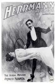There are various forms of portable servants for fixing to the back of a table or chair. A description of one for the use of a chair will give a clear idea of the construction of others. A piece of half-inch board seven inches by five inches is covered with green baize and slightly padded on one side with cotton wool to prevent injury to any fragile articles. To this is screwed an iron frame of the same dimensions as the board. The frame, which carries a network, is screwed to the board in such a way that it will fold up flush with the same, the whole being when closed under one inch in thickness. The frame carrying the network is prevented from opening too far by an iron bar screwed to the back of the woodwork.